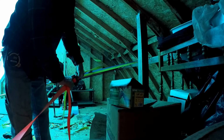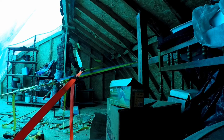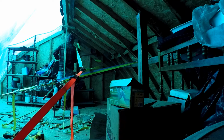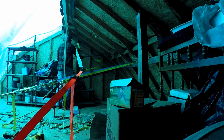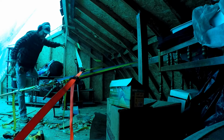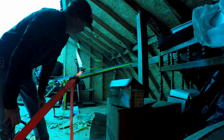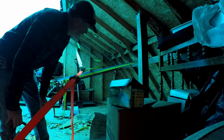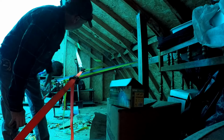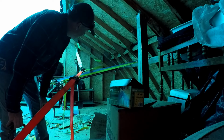Starting to think that that gable was kind of where it's at when it was built. I'm getting zero movement here. Granted, I'm pulling more down there than I am here. Okay, I got some pretty good pressure on that thing and it's not coming in. The homeowner was asking me to double up those rafters, sister on the gable, and I'm wondering if he knew that the OSB never really broke properly on there, and that's why he wanted me to do that. I'm gonna go with that.